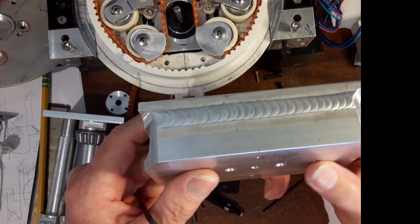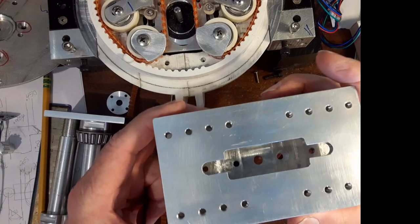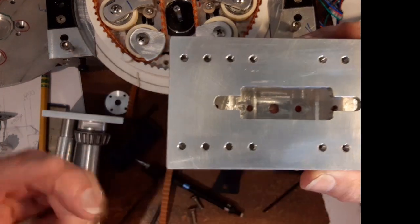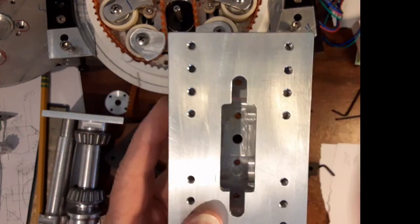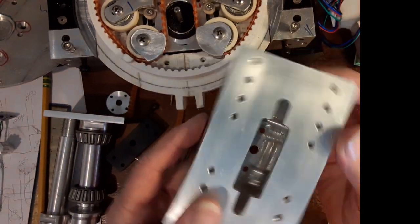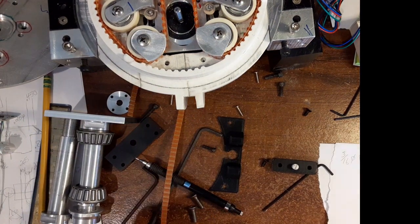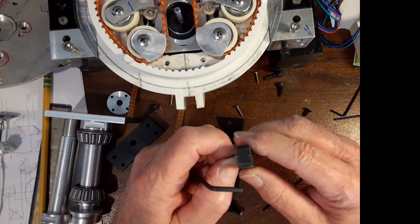You'll end up indicating it — once this unit is set up, you indicate one side and that's probably where you want zero to be, because everything is square to these sides so your jaws are square, your piece will be square, and everything will look good when this is all together. The rotation: when you set it to zero, it'll be zero this way, whatever you want to do. That's what I'm working on now, trying to get this going.